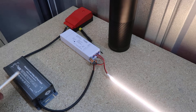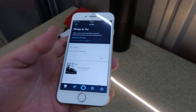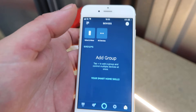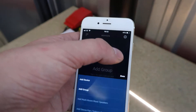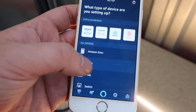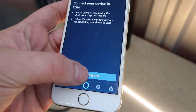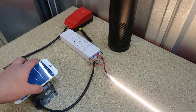Next you're going to want to go to your Alexa app. Go to Smart Home, which at the time of recording this video is at the bottom right-hand side — it does seem to change. Click the plus icon in the top right, then Add Device. You want to add a light, and when it asks you what brand is your light, scroll all the way down to Other. Hit Discover Devices. Remember this can only be discovered if it's been powered on in the last five minutes.